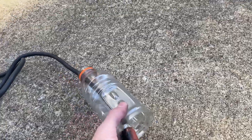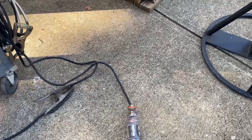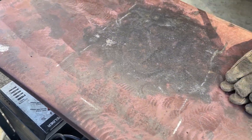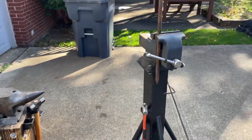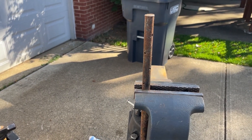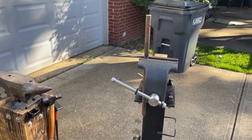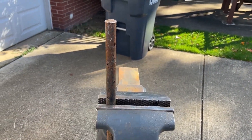I have my ground clamp hooked up to one of the leads and my stinger hooked up to the other. I have a little Gatorade bottle as extra added protection on the ground end so I don't accidentally arc one end to the other. When you turn it on, make sure the rods aren't just sitting on a table — set them on a glove or something insulated. We have a concrete stake here — there's no way I'd be able to bend that with just a hammer. If I heat it right in the middle I can get localized heat, better than a forge where the whole thing would get hot.